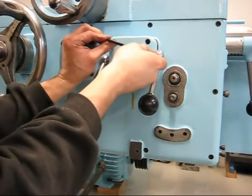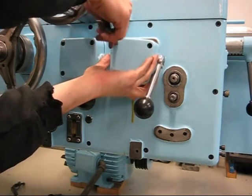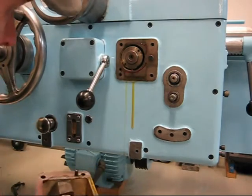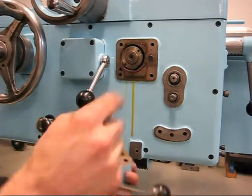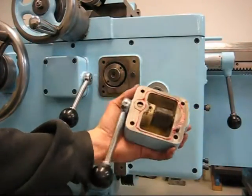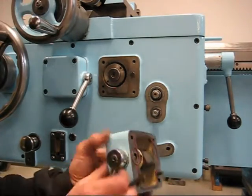I should have loosened all the bolts the same way, because the clutch keeps pressure on everything here. I can just take that apart too. I should have put sealant on this part — not the part you can see, but there. There isn't any contact there, so I'll put sealant in the correct place now. Evaluate both faces where there is actual contact before you put on the sealant.